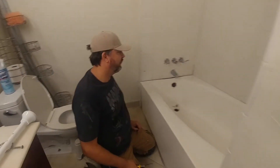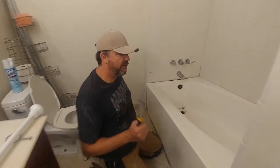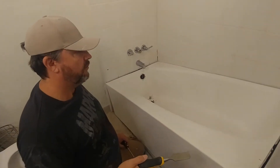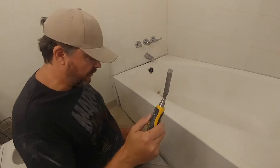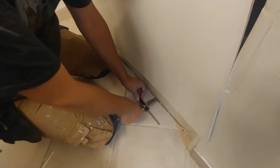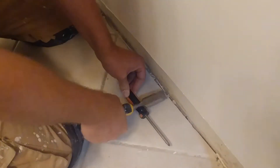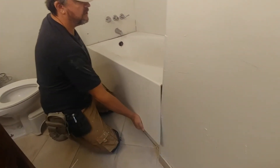Back to do the tub — review what's underneath. Let me tell you how we got this off. We cut all the silicone around this. Then I took a chisel and laid it underneath the edge, put it right here on the top of the screwdriver to give me leverage so I wouldn't bust my knuckles, and worked it up along the front. Once I got my hand grip on it, I can lift it up. So it's coming up now.